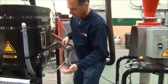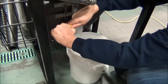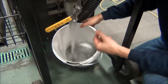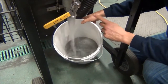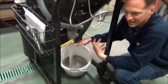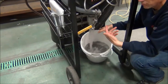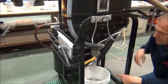To empty the immersion system, you have a water level here. You're going to see this water is very clear — there's sediment in the water, but not a tremendous amount. It's crystal clear water with some sediment in the bottom. That is the efficiency of our HEC. Our high-efficiency cyclone spins the material out of the airstream, so that ultra-fine dust of 15 to 45 microns on average is not going to carry over, and your liquid bath remains clear.